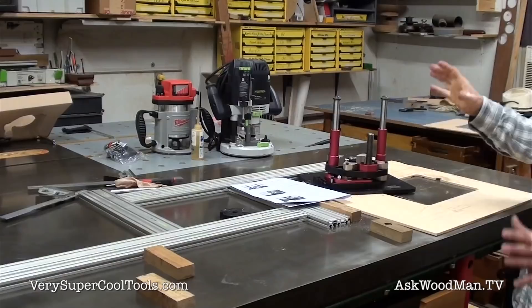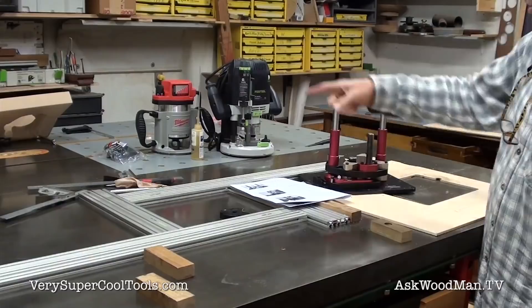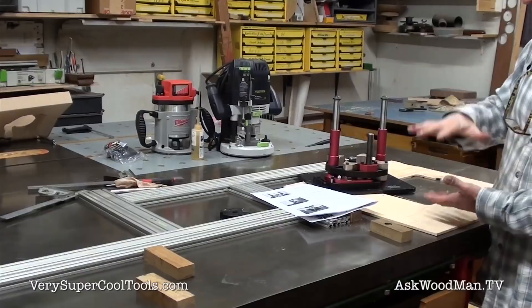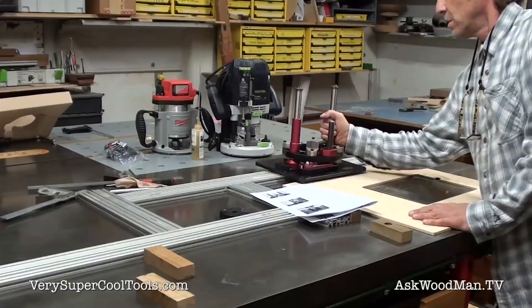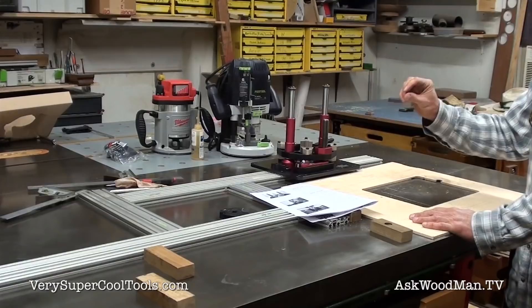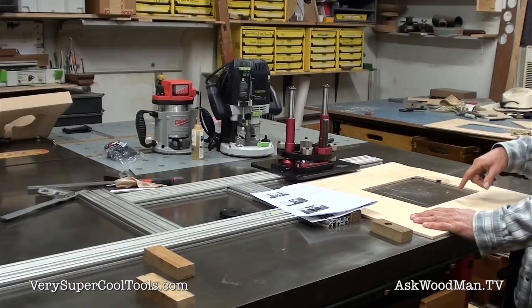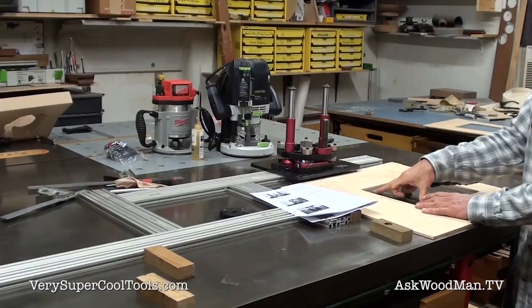This lift is pretty heavy — it's a solid fabricated thing, not light duty, and the router is heavy too. So there's going to be a lot of weight hanging on it. The way you level it is with set screws, but with plywood — even Baltic birch, which is pretty tough — it's not tough enough to withstand the constant weight and pressure. It would eventually make dimples and depressions. So I'm going to trace this piece onto a sixteenth-inch plate steel sheet, cut it out, cut a three-quarter inch rabbet out of the inside, and use it as a liner that sits inside the rabbet in my plywood. The set screws will pull to the steel, and I only give up a sixteenth of an inch.